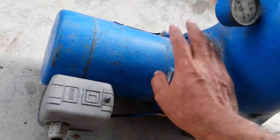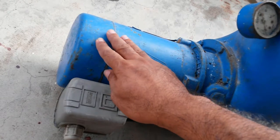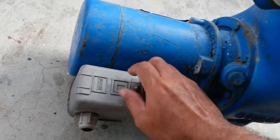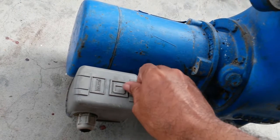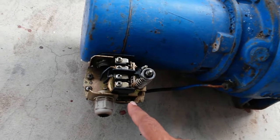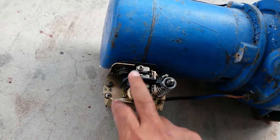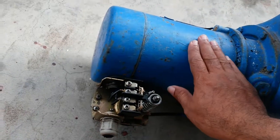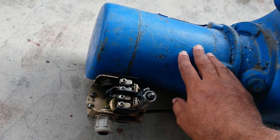This, let's separate. This is the motor assembly, motor back chamber, start capacitor should be in here. This, let me turn this out and see if I get it open. Come on. Right, that's your pressure switch. Right, so supply on both sides, switched contacts, and this will most likely be an induction motor.